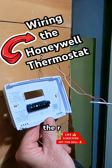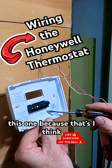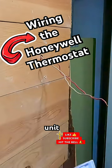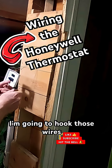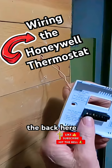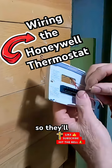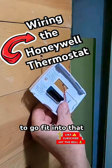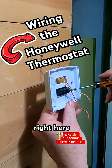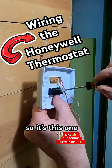I'm going to put the white one on the W and the red one on the R. I don't need to use the third wire because that's for air conditioning, and this is a non-programmable unit. So I'm going to hook those wires up right now. The breaker's off, so I'm going through the back like so — I've already stripped these wires down so they'll fit into the terminals. Let me count: one, two, three, four, five — okay, it's this one.